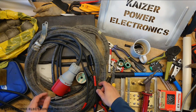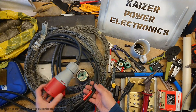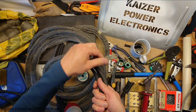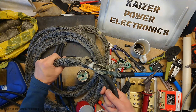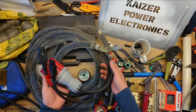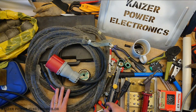I forgot to time-lapse the previous step — that was putting on the 230-volt AC plugs. This goes into my safety box, this goes into my cooling fan and driver on the Tesla coil, and we have the AC mains supply. To terminate the copper braid, I soldered on two earth braided connections — just two for redundancy — and then a cable tie to relieve stress on the braid itself. That should be enough cable length to connect to my three connections on the coil. The fiber optic cable will have to run underneath this; I did not want to put that into the braided copper — it's too fragile to move around with this heavy cable.